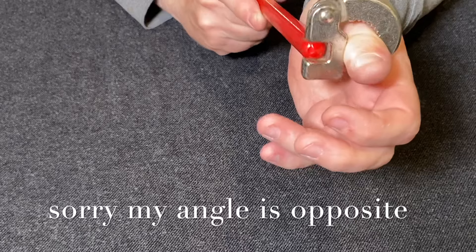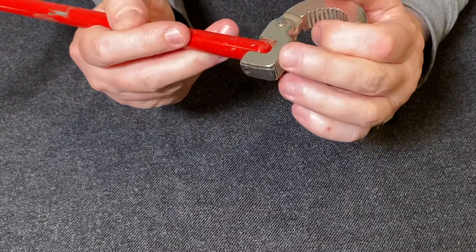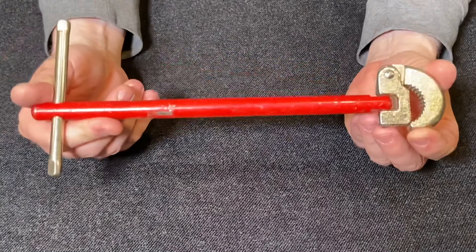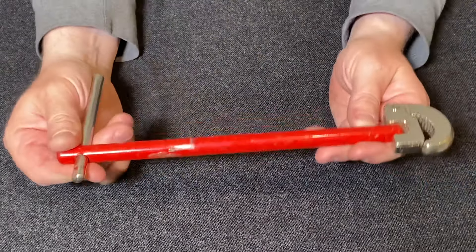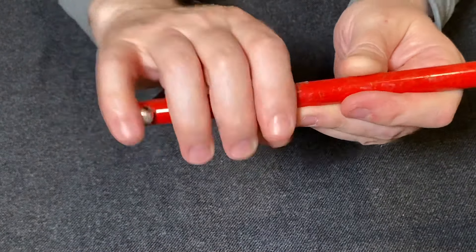You can see my thumb twisting clockwise. To the left is going to be to take something off. The way these jaws are set up, this one single jaw pivots — got a little spring in there — it comes out, grabs onto the pipe, catches right there, and you're able to grab. This straight arm style is common; this is what a lot of old plumbers would have in their bag. I personally have never owned one — I borrowed it from one of my co-workers, and she was telling me she's had to use a pipe wrench on it to get some extra torque.